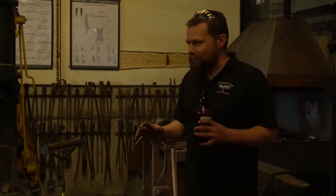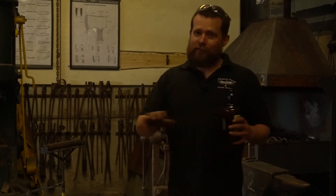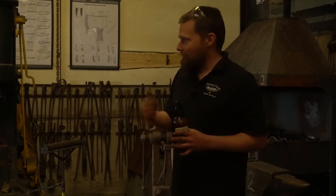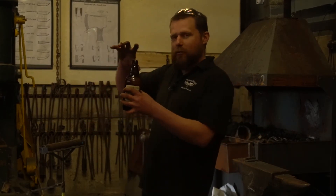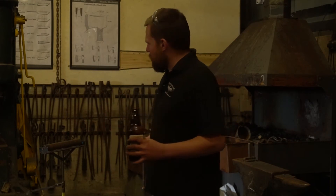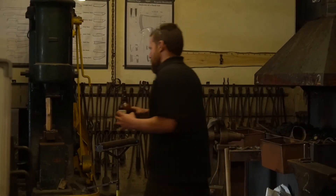The big Anyang doesn't get used every day — she's a bit of a grumpy old girl and does need a bit of TLC — but for the most part it works and runs. The smaller 40-kilo hammers cope with the majority of work I'm doing: forging tapers, punching holes, texturing bars. But the big Anyang got used quite a lot last year for a big job for the Botanic Gardens making railings up to entrances of bridges — god knows how many hundreds of metres of 25mm square needed texturing. The nice thing about the Anyang is it's still running off its Frankenstein electrics from 1937, a good year. When I installed that hammer I called an electrician up because I don't know anything about electrics — the sparky turned up, I'd bought a star delta box as Alex had told me it was a star delta starter, and the sparky got all his tools out, then announced he didn't know what it was because there were too many wires sticking out of it — so he dragged in the old electrics.